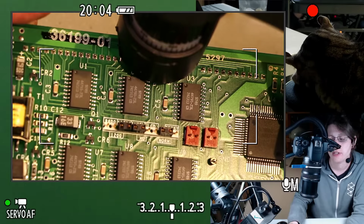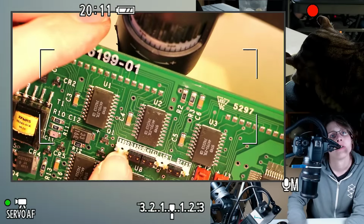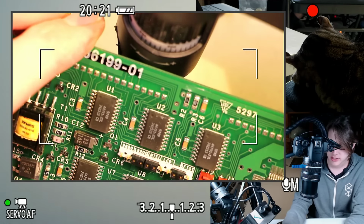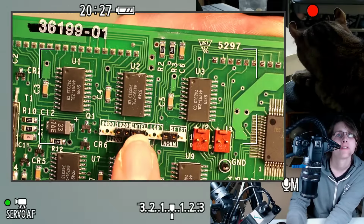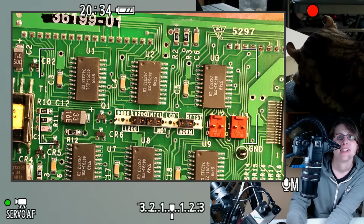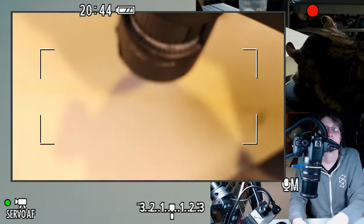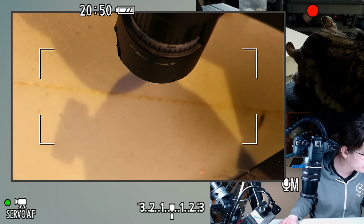So over here on the mode switch side, yeah, we have 9600 or 19200 baud. Intel mode, I think these are in relation to the parallel bus. Oh, here we go. Yeah, so there's a parallel bus that you can configure either for Intel, Motorola, or traditional Hitachi LCD controller emulation. And then there's the self-test switch, which is, I think, what we're looking for. Well, let's get a pinout. I'm going to do a quick search for the datasheet. If the datasheet doesn't show up easily, we'll just get the pinout from the schematic we already have.